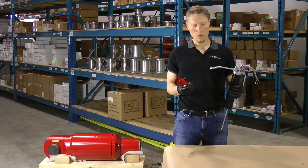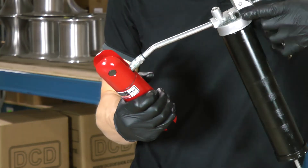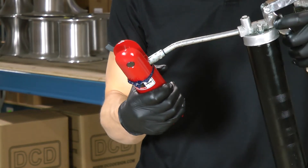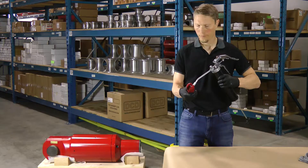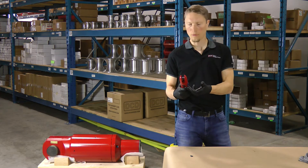So for this swivel, you're going to use your hand grease gun connected to your grease zerk securely, and pump slowly until you have grease coming out the split line. You can continue purging until it all comes through and you're seeing clean grease.